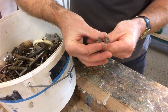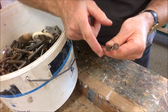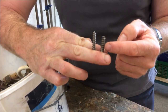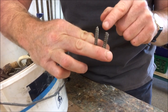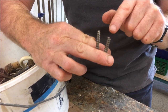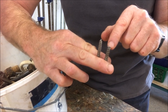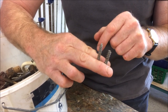These look like two similar slot head screws which have a bit of age. You can see the rusting on the top, which is a good indication that they have some age. But if you look at the underneath, they actually reveal more. This screw here has deeper augering — the windings — while this screw is more shallow. Also, the main indicator is this screw has no point, whereas this one has. If you find a screw with no point in your piece of furniture, it's a good indication that the piece was manufactured prior to 1890, because pointed screws came into common usage after 1890.